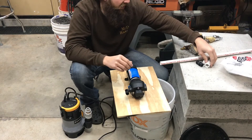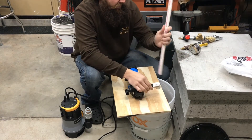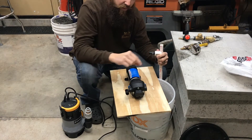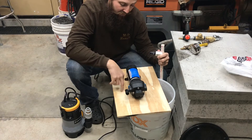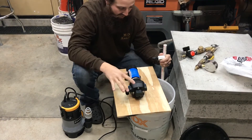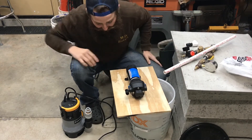On the discharge side I've got some couplings and fittings and I'm going to put the discharge hose on. For the inlet or suction side, we're going to take this 90-degree half-inch PVC elbow, lock it in pointing straight down, connect it to PVC, and hard-pipe the suction line straight up from the bottom of the bucket about an inch out, right into the pump. We'll probably mount the pump to this board with the manifold system sitting on here too — everything on the bucket, easy on and off but fairly solid.